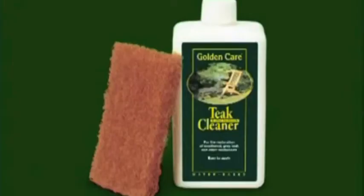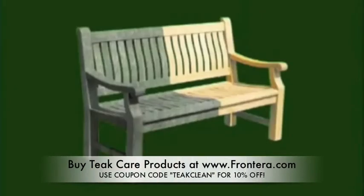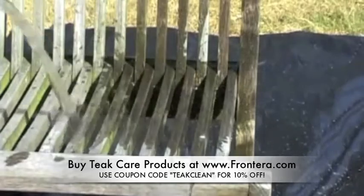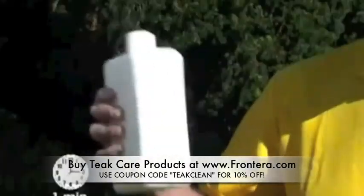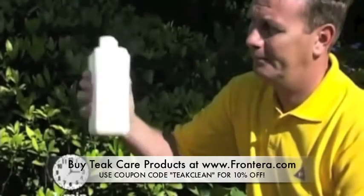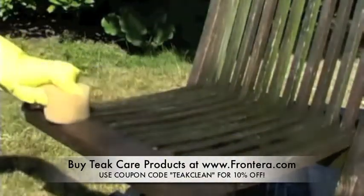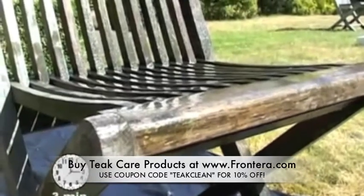With our teak cleaner and a few hours of industrious work, your garden furniture will look like new again. Wet the teak furniture thoroughly with water. Shake the teak cleaner bottle briefly before use. Apply the cleaner to the teak with a sponge or cloth and allow the cleaner to penetrate for 3 minutes.